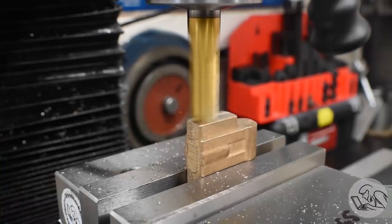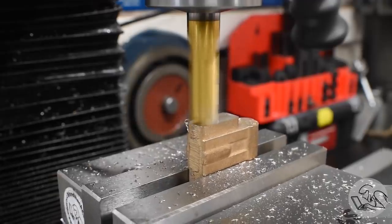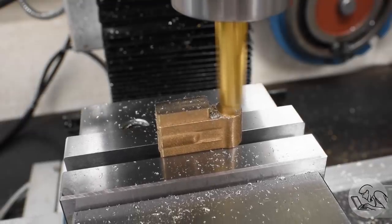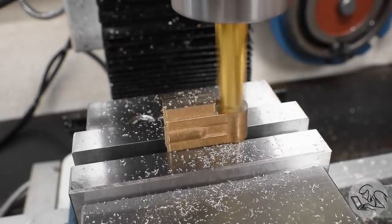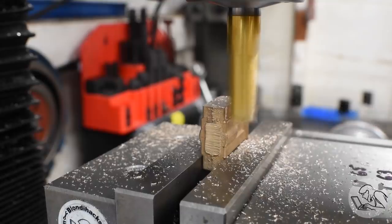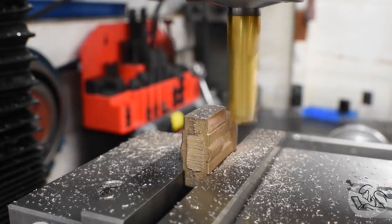I measured the overall width of the casting before I started so I know how much to lower the outside edges. The reason I've set it up this way is because there's a whole bunch of surfaces here that all need to be flat at the same height and square to each other. By gripping it by one leg it gives me open access to the entire other side of this casting, so I can bring the outside of the clevis down to the right height and run it around the outside of that leg, bringing all of those shoulders to the right width.